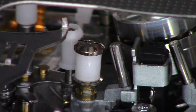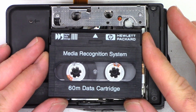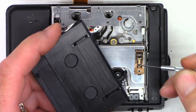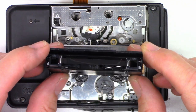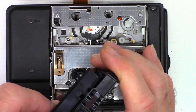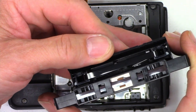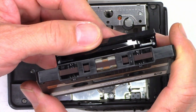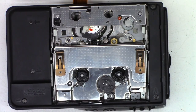Mind you, this is in macro zoom mode, that's why it's kind of grainy. Here's the tape that goes in it — this is an HP digital data storage tape, but it can record audio. Let's get it open and see what's inside. There's the tape inside, just like a compact cassette. Look at the color of the DAT — much, much deeper black, which means a much higher particle density, which is what you need when recording digital audio on a 1/8-inch piece of tape.